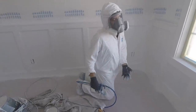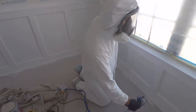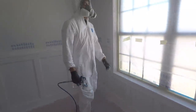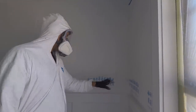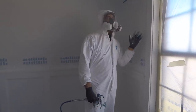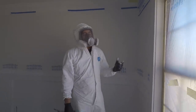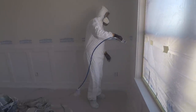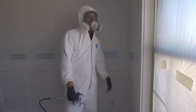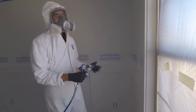Notice how I walked on my knees right there just to avoid stopping and to keep a consistent flow. I do that a lot. In here it's carpet so I don't need knee pads, but generally when I spray I do wear knee pads so I can just walk on my knees comfortably. You guys may have noticed too when I spray these sections I hit the top first — that's because you always want to hit your small edges first, up against that casing, because if you spray all this big section and then cross those edges it might leave some inconsistency with the overspray that lands on what's already sprayed.